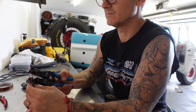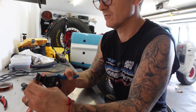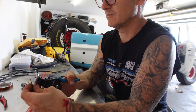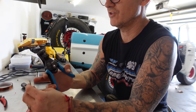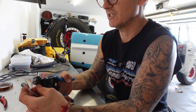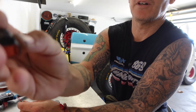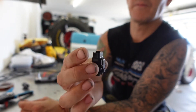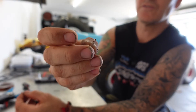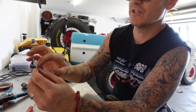It's 20. So strip all these. 18 or 20 is going to be fine for a DTM connector. I've got a DTM 4 which basically everything the CAN hub runs off of. Tiny little thing, and then these are the sockets. Put that on there — it's pretty good.